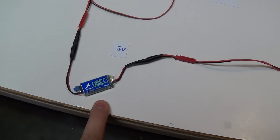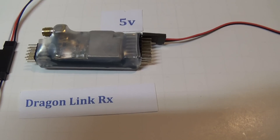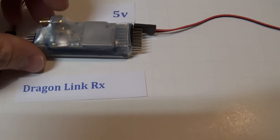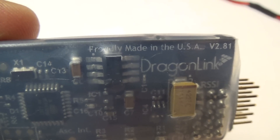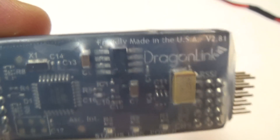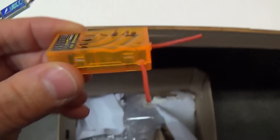Using a 3-cell 12-volt battery is perfect because two of our components operate at 12 volts. We can use a small universal battery eliminator circuit, or UBEC, to step that 12 volts down to 5 volts to power our receiver. I am using a 12-channel Dragon Link receiver for this demo — it's worth its weight in gold for long-distance FPV flying. But to add a camera switcher, you can use just about any receiver you like, such as this cheap orange one here.